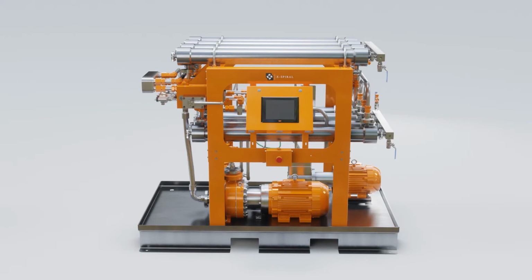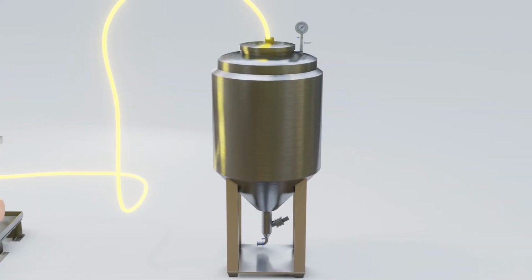The stream continues to an agitation tank for remediation if necessary. In this step, we add an adsorbent like carbon to remove residual chlorophyll and other contaminants. Unlike other methods, this process allows us to use our adsorbent of choice for supplemental remediation.